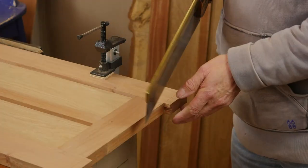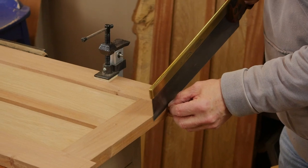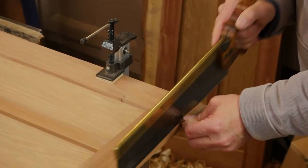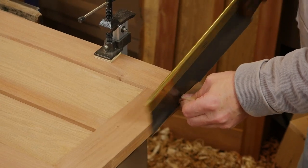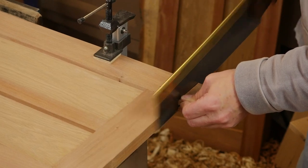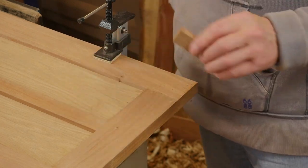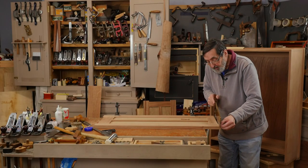What I'm going to do is line up the saw here. Now I don't have much room, I've got a cabinet behind me. Follow my knife wall. Keep it lined up with the top of the door in this case, so I've got no tear out on the underside. There's a tear out on the waste wood, which didn't really tear out even there.